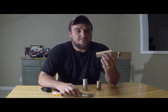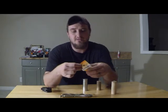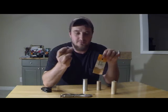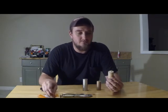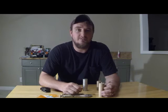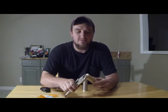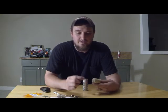I just took round stock of wood — you go to Lowe's and you can get these bolts. They're wood screws on one side and quarter-20 on the other. So all you have to do is cut the length you want. I drilled the quarter-20 hole, so it is in there and it locks in there, but you want it loose enough that you can still get it out if you need to. Be careful not to squeeze too hard so you don't ruin the thread. You just barely squeeze and see it starts to come out. To get them in there, after you drill your hole, you can put two nuts on there, lock them together, and twist it in.